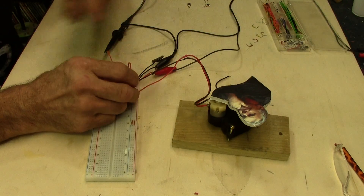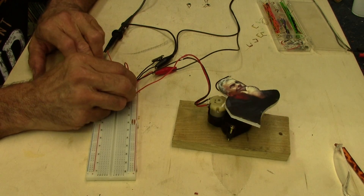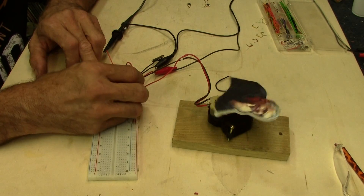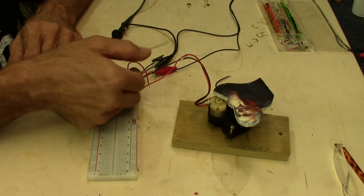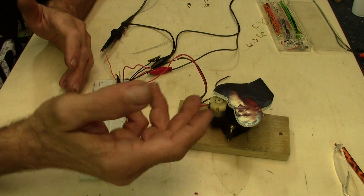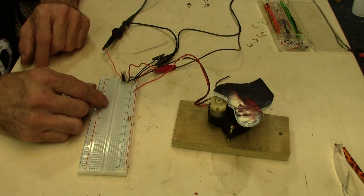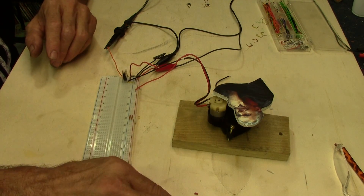Now let me bump up the voltage to 12 volts — we'll get a little faster rate of spin. You'll really see the difference when I just touch it a little bit, or if I do it a lot, or wide open. So what we can do is use a microcontroller to modulate those pulses that trigger the gate, and actually alter the speed of the motor. That's what I do when I use an Arduino to control robots — I'm just sending pulse width modulation to the H-bridge, and the H-bridge is controlling the motor. We'll look at what that looks like on the oscilloscope — you should see a square wave.